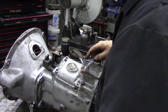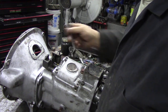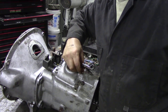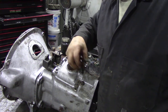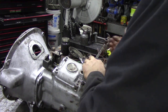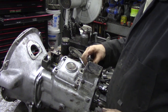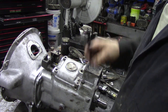The next thing is we're going to take this one off here. This is another plunger. Now inside here there should be some steel balls - there will be a steel ball in here too with a spring. We're not too concerned about that because they'll probably just drop in the gearbox. But if you're going to take the cover off once it's on the car, it can be problematic. Anyone can take anything to bits - it's putting it back together that's the problem.